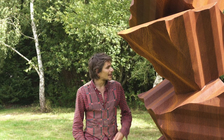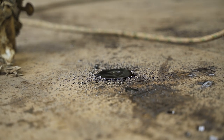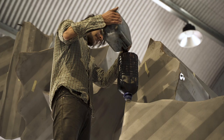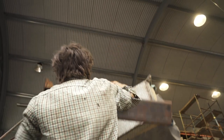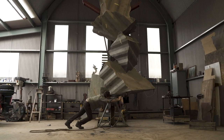Cor-10 as a material likes to get wet and dry out. It occurred to me that the interior of this sculpture is likely to be constantly damp, and therefore some protection against corrosion was necessary inside. The best way to protect the interior was with a sort of cavity wax that they use on cars. The best way to get that in was to fill up each lump and slosh the thing around. I'm a great believer in the saying that necessity is the mother of invention — this tricky process required one hell of a good invention.